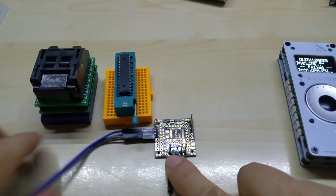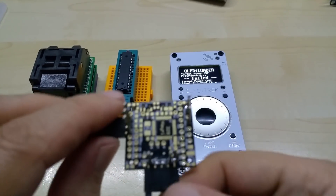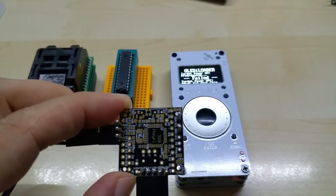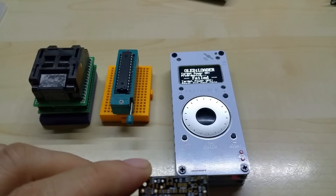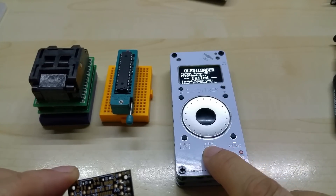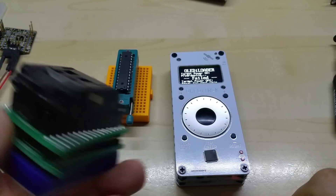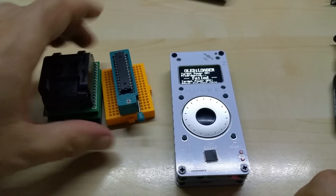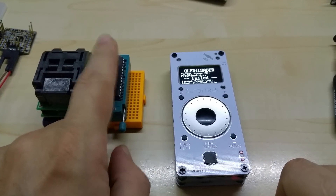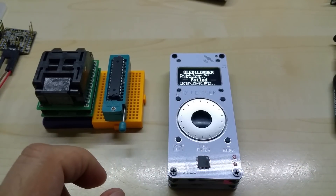What I actually thought of is having the pinout for the chip right in the front here, so you could technically get your SMD chip, place it on there, press down on it slightly, press reset, and then upload the code — so you don't have to buy this huge brick. This would obviously only work with SMD chips and not the DIP version of the 328.